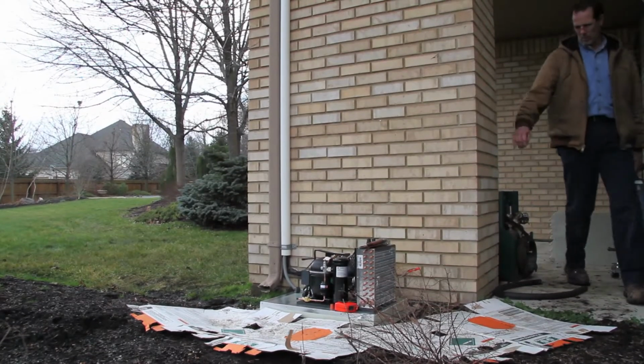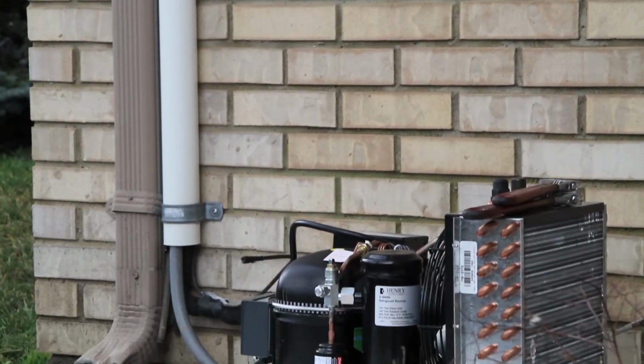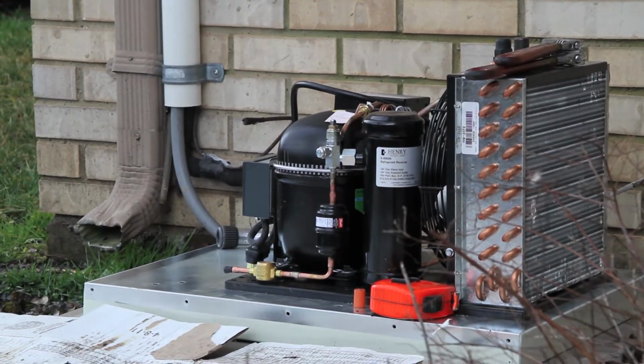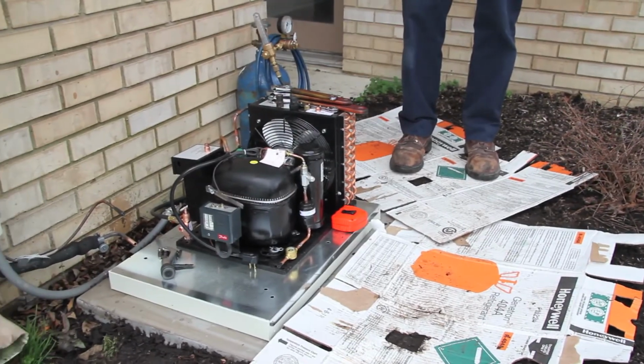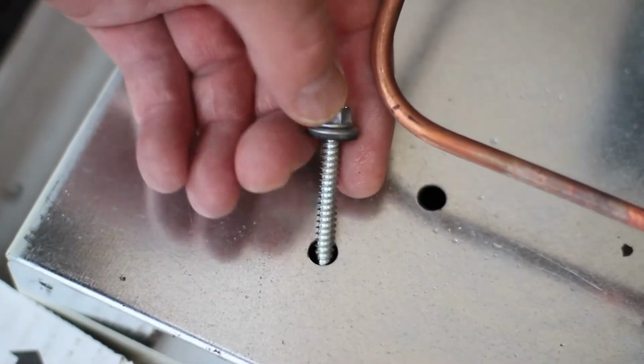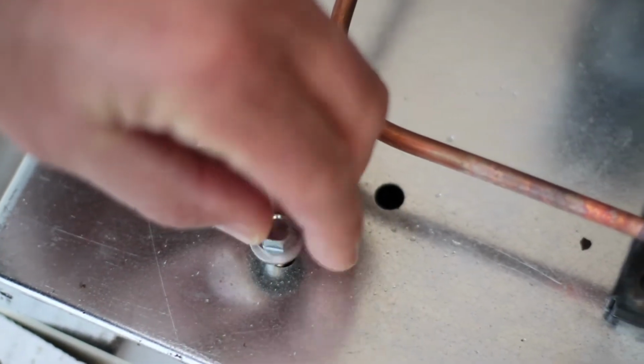We begin our BCS 1000 condensing unit installation on a wet day. The outdoor unit, shown here, is sitting on an OE100 custom outdoor cover base, and both rest on the outdoor pad, which you need to supply. We also supply indoor condensing units. First, we secure the condensing unit to the pad with self-tapping screws.